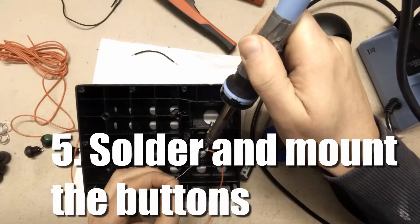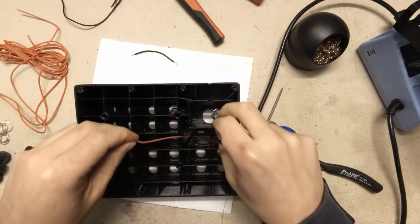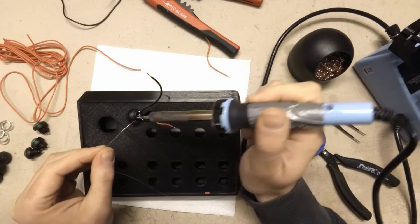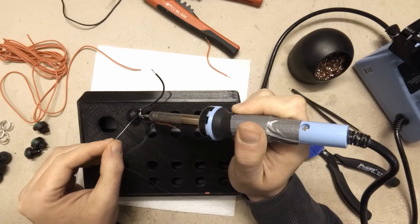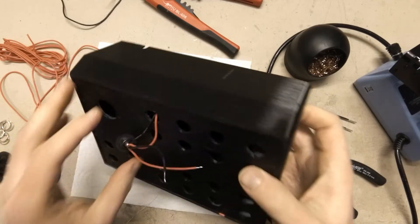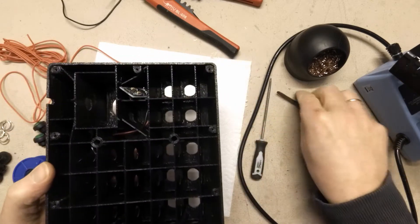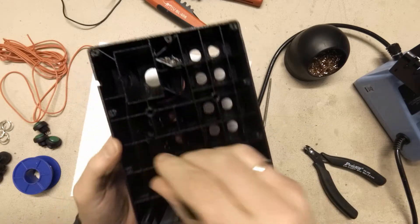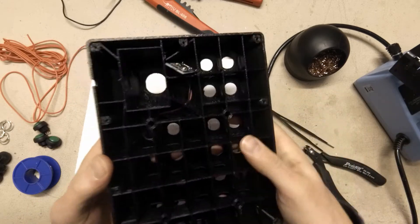The assembly is tricky because of the lattice inside. Finally I was able to solder all 20 buttons outside of the enclosure. I threaded the wires through the nut, then through the box, soldered them, inserted the button inside, and the most tricky part was to screw the nut. I used small needle nose pliers and a lot of patience. This was also the most time-consuming part of the build, but it went seamlessly.